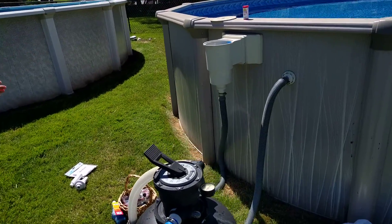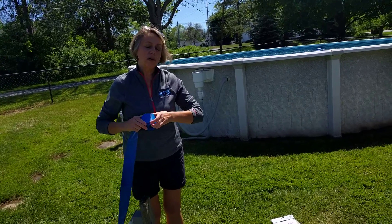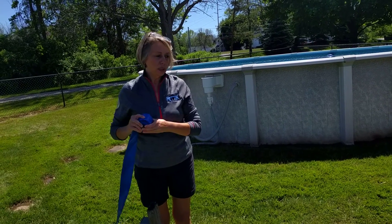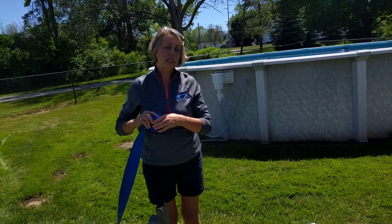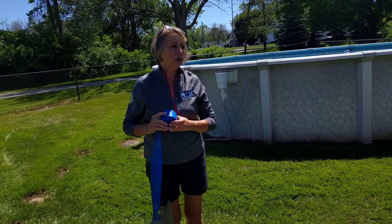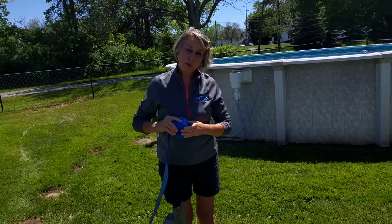The baskets are all clean and ready to go. I would always say to you — we're going to talk about vacuuming next — make sure that you're cleaning, you're vacuuming, you're backwashing and rinsing, and then adding fresh water before you add your chemicals. There's certainly no reason to add chemicals just to pull water back out of the pool. So this is going to be your first step and then we will add the chemicals. And then we'll talk about vacuuming — we'll be right back.